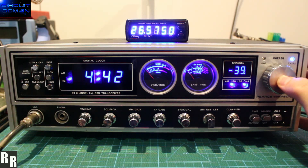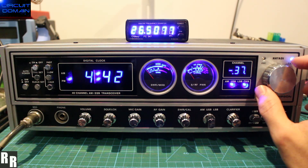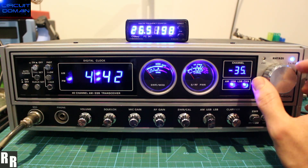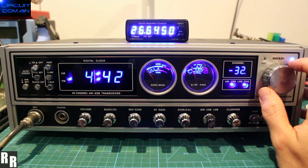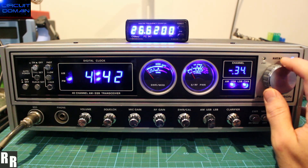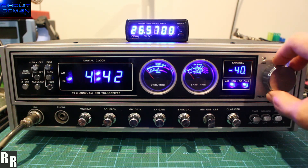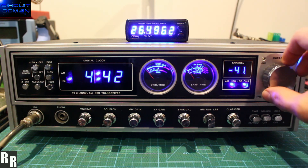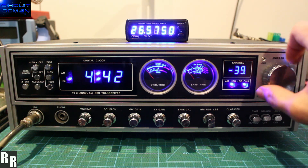Let's get 5KC stepping on anyway. 1, 2, 3, 4. Let's see where it really starts to lock in on a normal readout. Negative 31, negative 32, negative 32 with a dot. Just walking its way down. Somewhere around there it starts to suffer. The PLL is definitely struggling when it gets down that low — minus 40 or so.